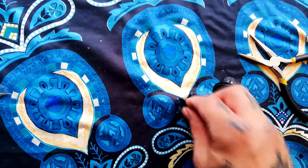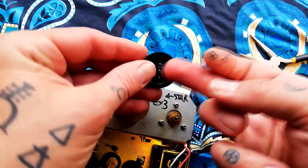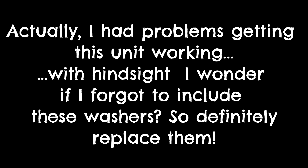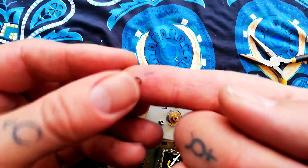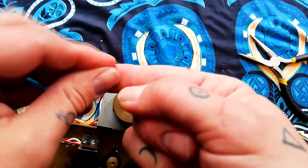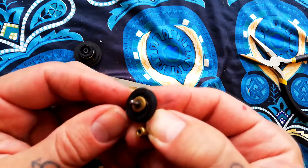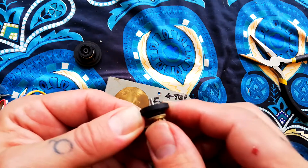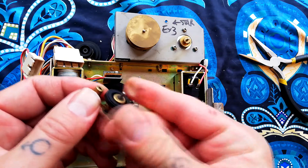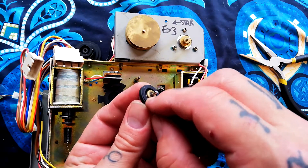That one did ping, so be careful. It looks like there were washers on either side of the idler assembly — it probably wouldn't cease to work without them, but be aware they're there. This is blurry because I'm in manual focus, but you can see why it's called an e-clip or c-clip — it looks a bit like a C or a euro sign. Although not completely deteriorated, the idler tire is a bit shiny and smooth, which is probably why fast forward and rewind wasn't working well — it's not gripping the serrated edge of the reel tables. I can also feel some sticky spots leaving black marks on my fingers, so it definitely needs to be replaced.